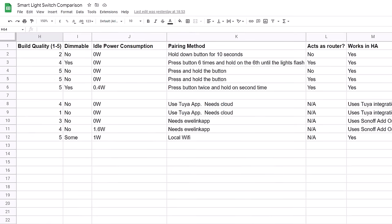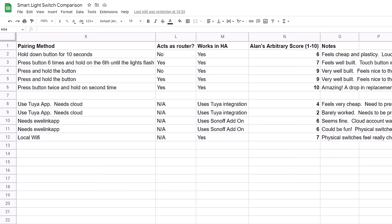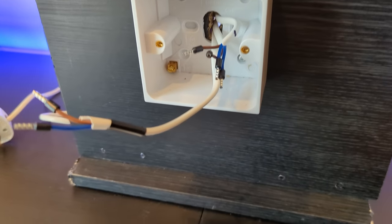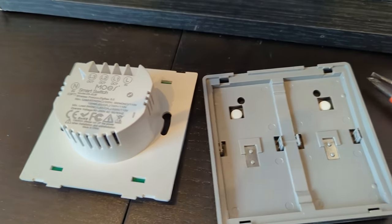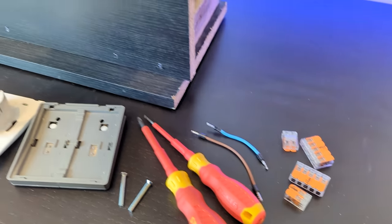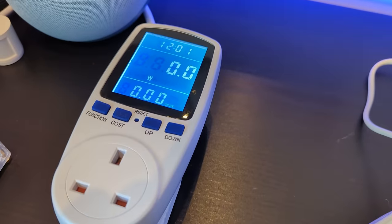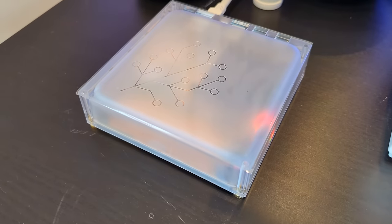I wrote down my criteria into a spreadsheet so I could give each light switch different ratings and eventually a score out of 10. I also recorded the price I paid for each switch in US dollars, whether or not it needs a neutral wire, and other useful notes. I've put this into an article on my Home Automation Guy website, linked in the description. The testing was done in a test rig that my dad and I made last summer — it simulates two lighting circuits, can be unplugged from power so I won't electrocute myself, has a fused plug, and plugs into a power monitor so I can measure how much power each switch draws. I'll be connecting devices into my Home Assistant Yellow and pairing Zigbee devices with ZHA, and also testing shortlisted devices in Zigbee2MQTT.